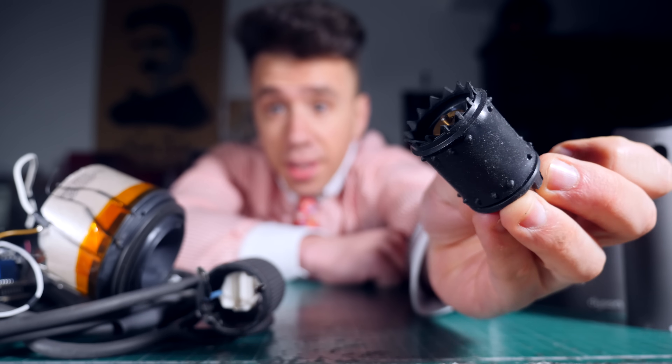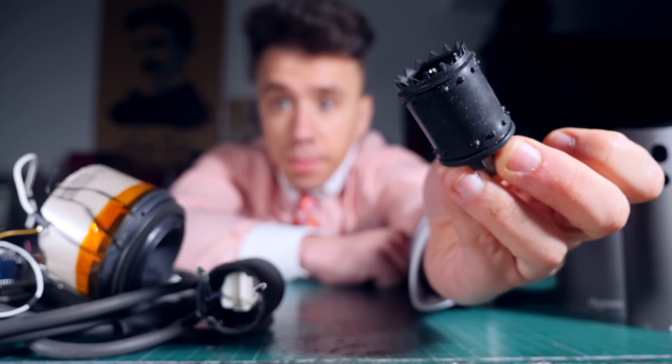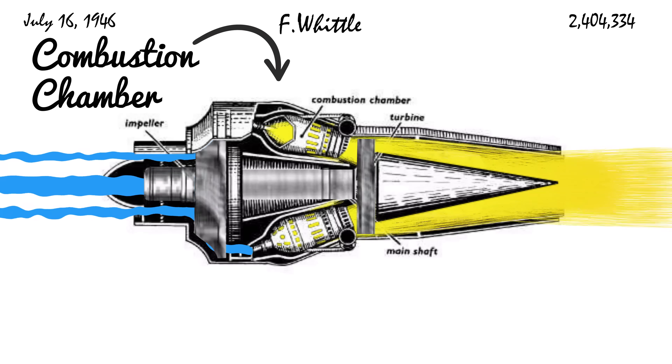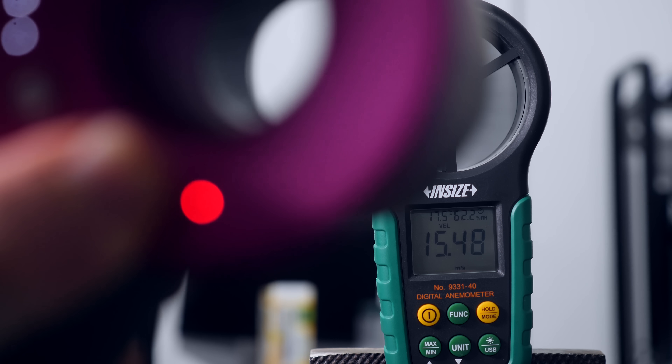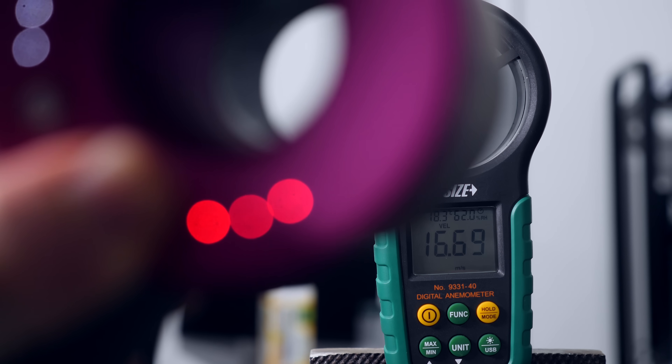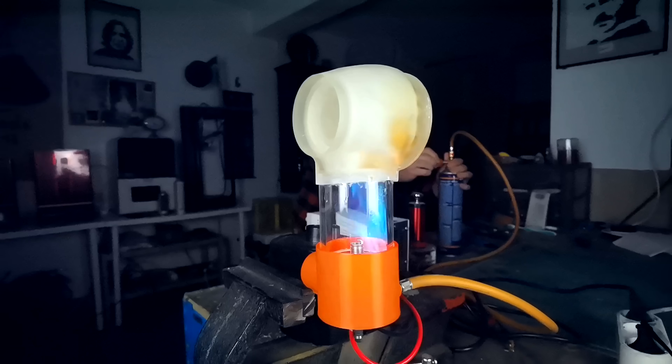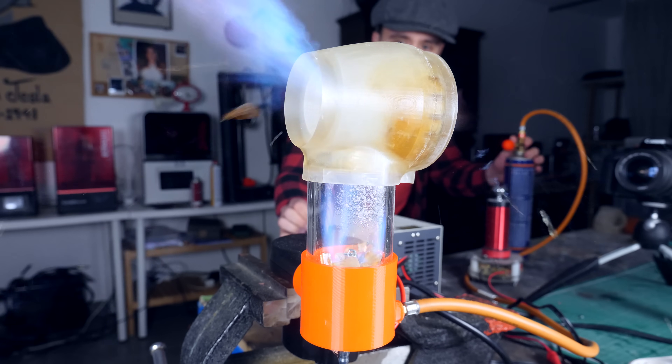This compressor is tiny and very powerful. I really like jet engines, and in a jet engine the more air you can push in, the more fuel you can burn and the more thrust you get. If you turn up the heat on a hair dryer you get higher output speed — this dryer heats air up to about 80 degrees maximum. Imagine raising the temperature to 900 degrees Celsius. My plan is to turn this air dryer into a jet engine — add some combustion into the mixture. I tried something similar in the past and all I got was melted plastic. What I really need is to turn this part into metal using a metal 3D printer.